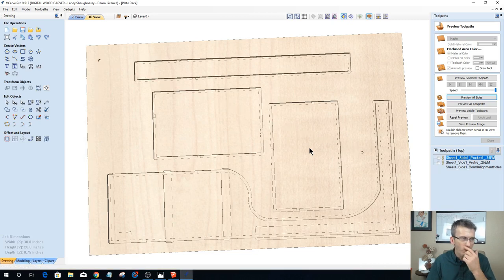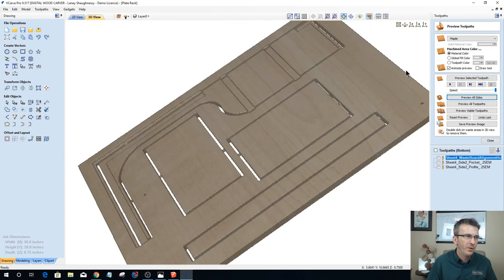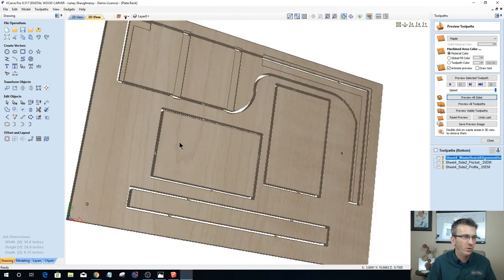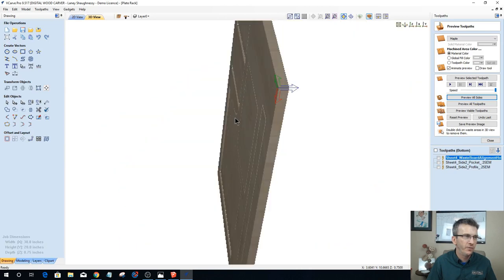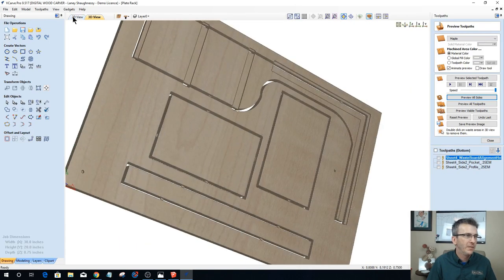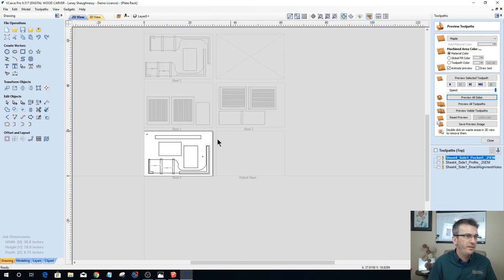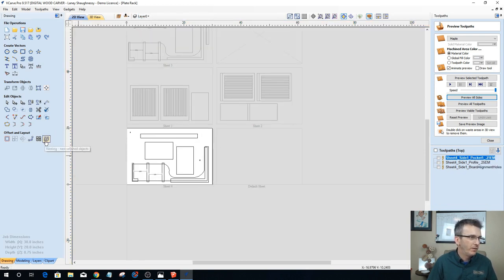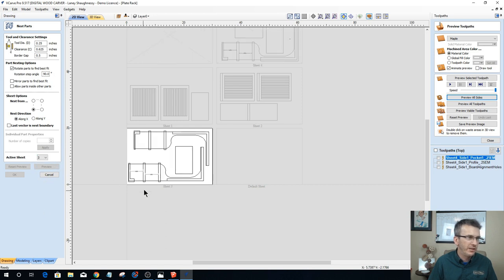All right, so on those parts, we should end up with 1/8-inch tabs cutting those parts out. Both sides, we've got our alignment pin holes and 3/16 of an inch pockets for that center rung. Okay, so that one's done. Let's go back to side one. Let's jump over and get this done real quick. Let's go to sheet 3. I'm just going to go 4, 3, 2, 1.